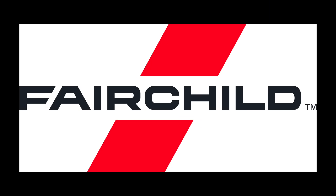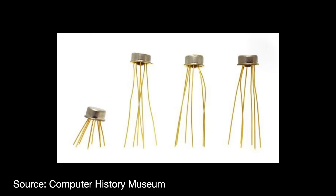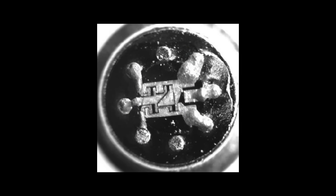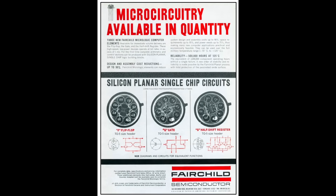Packaging took a big leap forward with Fairchild Semiconductor. When Fairchild started producing their revolutionary planar ICs in the late 1950s, they packed them in the same TO5 and flat pack packages they used for transistors, just with a few more leads. The TO stands for Transistor Outline. A TO5 kind of looks like a squid — basically a metal can and metal lid. The TO5's awkward round shape made it difficult to attach onto and arrange on a board, adding to labor cost. Worse yet, TO5s limited how much data the chip could take in and push out, maxing out at just 8 to 10 pins. Fairchild's new logic circuits needed far more than that, and TO5 packaging diluted the IC's advantages.